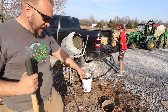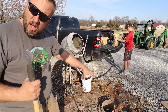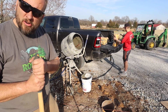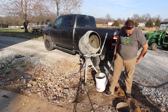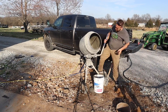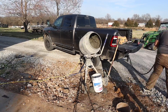Since that top partially collapsed, next time I do this I'll fill in around the tube at the bottom first, then pour the concrete in, and once the concrete sets, finish filling in around it — that's probably smarter anyway. At the beginning I said I was going to do a basketball goal and a mailbox, but I bought 10 bags of concrete and used nine of them just setting up the basketball goal, so the mailbox will have to be a project for another day.